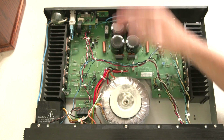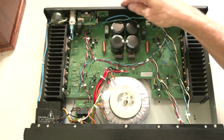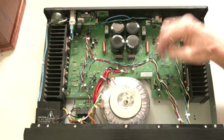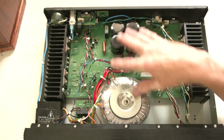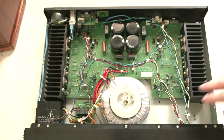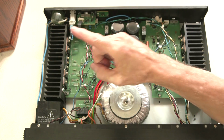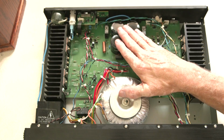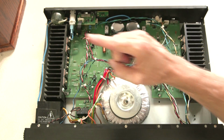What's really interesting is that the signal comes in and is not itself amplified, but rather an analog of that signal is generated by the transistors. And that analog, that's really the electrons from your power supply, are what goes out to your speakers. So that's really kind of interesting. So this power supply is really what's going to ultimately be driving your speakers. So this power supply is a very important component in your amplifier, because it's really where the electrons are coming from, where the electrical power comes from, that actually drives your speakers.